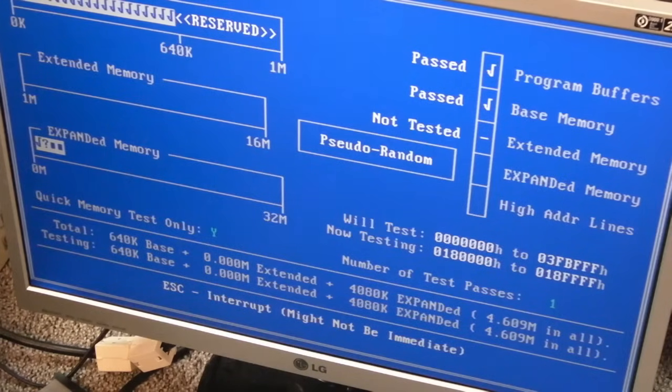Because that's the thing, if you get some of those really old PCs, some of the IBM ones, the original ones, you tend to find they had 512K of base memory, and you need a memory upgrade card to add that additional 128K, and perhaps provide an additional 384K. Because I think even the XT could support that, and this is how this works actually.